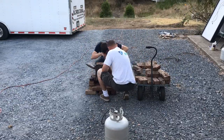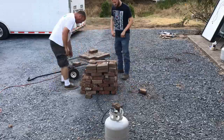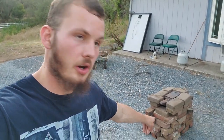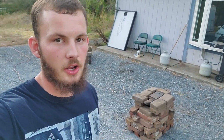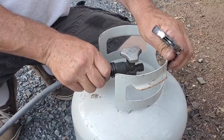Once it's there we'll be using the air hardening technique since it's A2. Our anvil right now is covered in brick — I don't know if that's the best way to do it but we're just trying to keep the heat in because we're going to lose too much heat. We got that burner going underneath it. We're going to light that and as it sits there burning, we're going to go fill our other propane bottles for the weed burner and see if we can get this thing up to 1800 degrees.